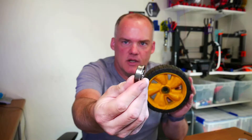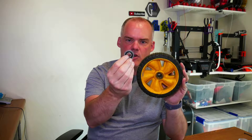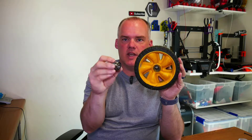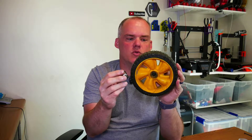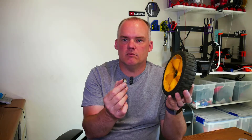As I do this wheel design, instead of just duplicating it in 3D printing, I want to make sure that I don't run into the same problem with plastic running directly on a metal axle shaft. So what I'm going to do is I purchased these flange ball bearings off Amazon — I'll put the link in the description. All I really needed was to make sure that the inner part of the bearing was the same size as the axle on the lawnmower, because I'm going to 3D print the way the plastic interfaces with the outside of this bearing, redesign it, make sure this wheel no longer is plastic on metal, but has full sealed ball bearings front and back, making sure the wheel spins true and hopefully has a longer life.